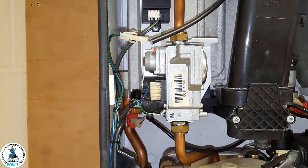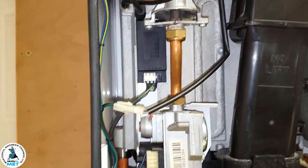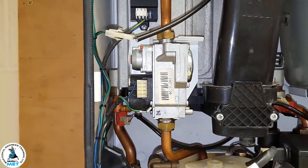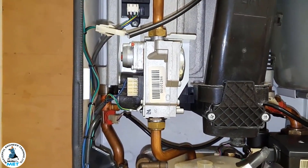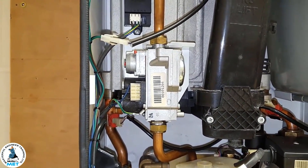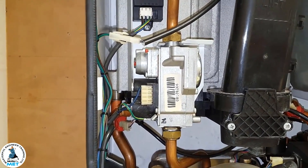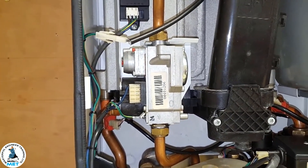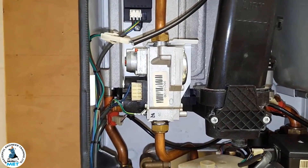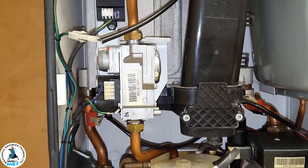Once the gas valve and injector have been exhausted it could be the burner. On these boilers I don't really like them because it's really difficult to tell, especially with the noise situation. Sometimes you have to just change the gas valve because it's non-adjustable. The gas valve itself could cause that noise problem, and this is really prevalent on these Ideal Independence boilers with this type of burner design.